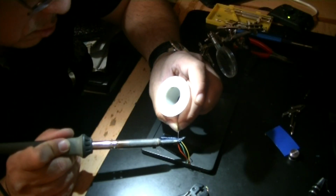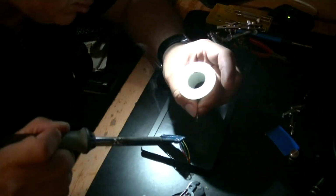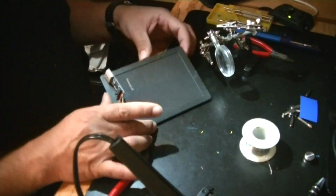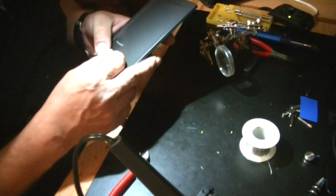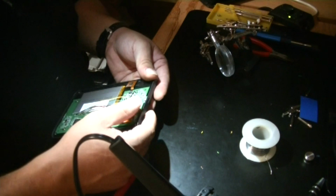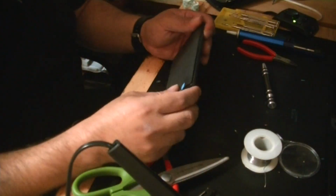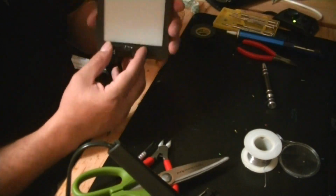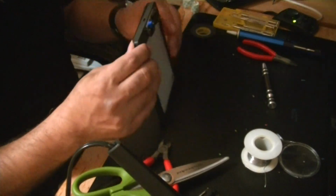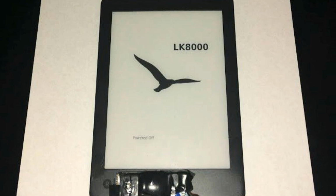After finishing soldering the cables to the Vario, I used the blue heat shrink wrap to cover the Vario, some black duct tape to further isolate the barometric sensor from the light, and a double face tape to glue the Vario to the front of the KOBO. Then I put the cover back, pressing firmly to close it. I was ready to connect the KOBO to the computer and, following the instructions of LK8000, install it on the KOBO and be ready to test it.